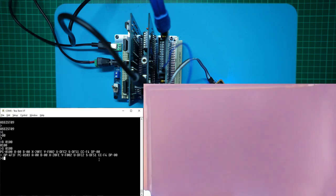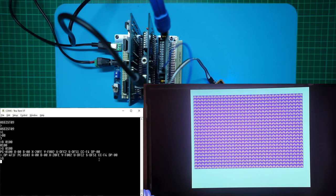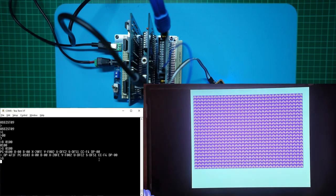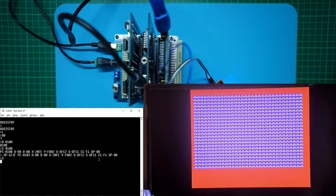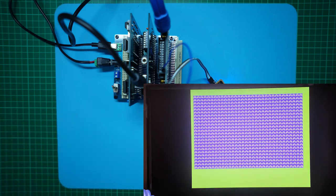I'll hit G to continue our test program. Looks great. As you can see, the original 2-second software delay loop based on our 1 MHz speed, which was changing backdrop color every second at 2 MHz, is now even faster when running at 3 MHz. So far we are looking good as a successfully running 3 MHz 6309 system.